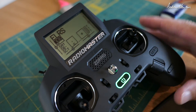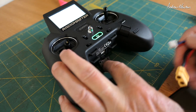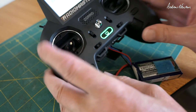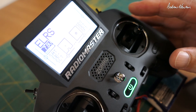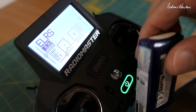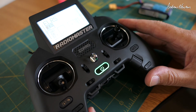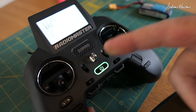If the battery gets too low — below about 6.6 volts or 6 volts — it'll start giving you a battery warning. You can have your little 2S battery and just plug it straight in the bottom. If you watch the battery voltage, it's now gone up to 8.3 volts, so it's reading the voltage from the secondary battery rather than the internal batteries. Really nicely designed — I think RadioMaster are on a winner with these radios. Thanks for watching.